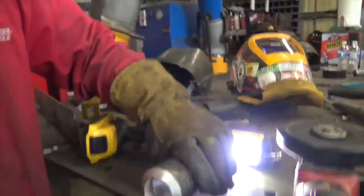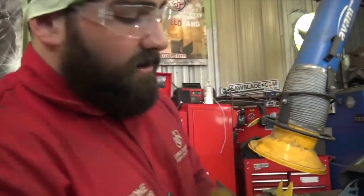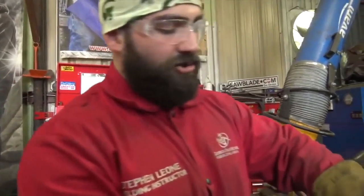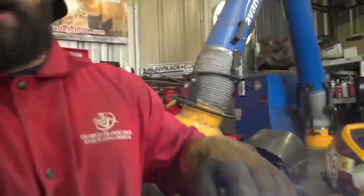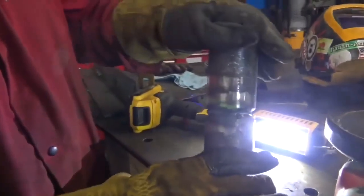It's kind of hard to see the root itself as far as the length of the pipe goes. If you miss tie-ins or anything like that, if you're taking a test it's done — you can't grind that spot out. Make sure you're within an eighth and you're tying in. If you have really bad tie-ins, maybe you need to feather more or feather less. Don't be over an eighth of an inch and no hangers.